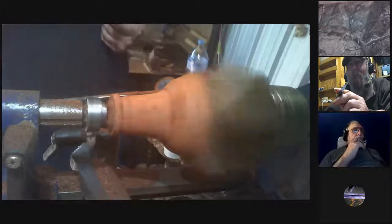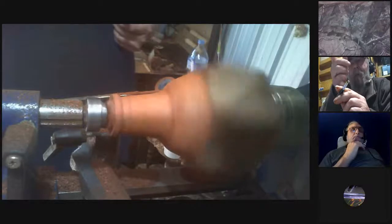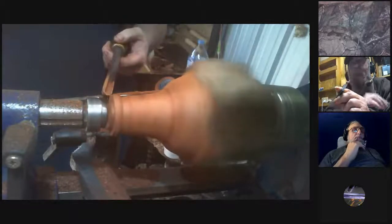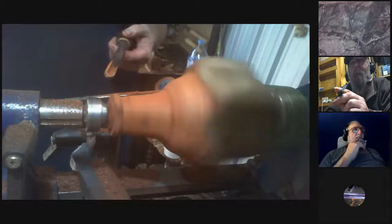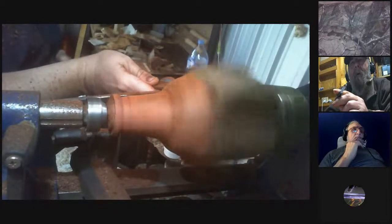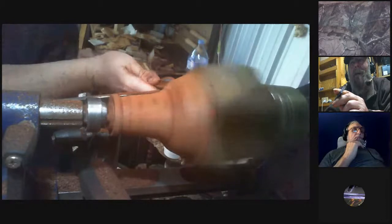That's starting to look better. Right, now, move up to the top, the square section. Yeah. And you're going to do exactly the same thing on that sharp corner where you've undercut it. So you're just going to take a slight slice off the square bit in a parallel line. And then when you hit that section, you're going to blend it into the bead that you've got there, all right? No, up on the square section. Yeah, that's nasty, that is. Face the chisel the way you want it to cut.